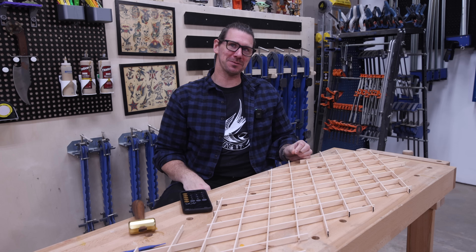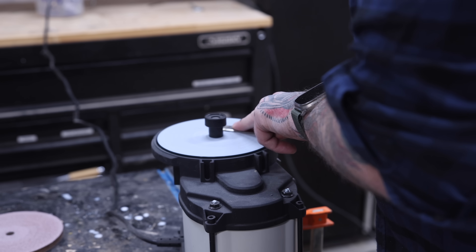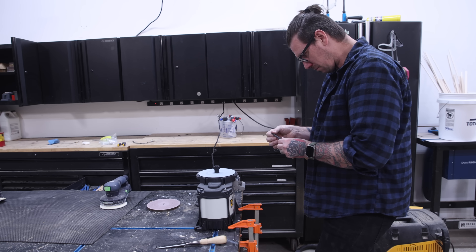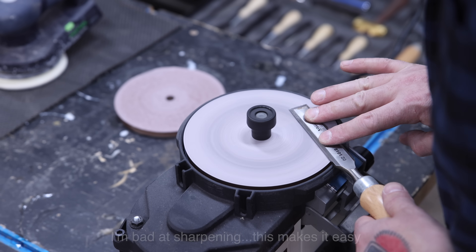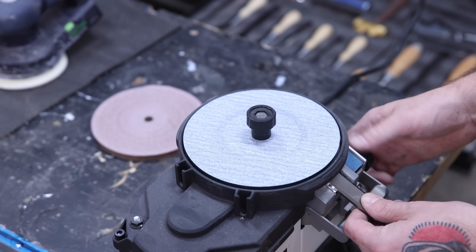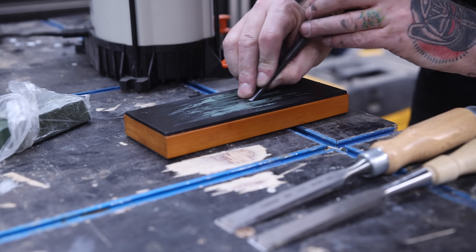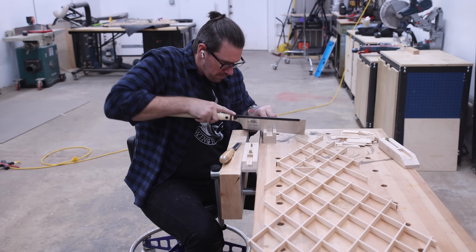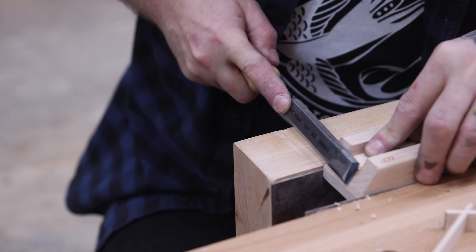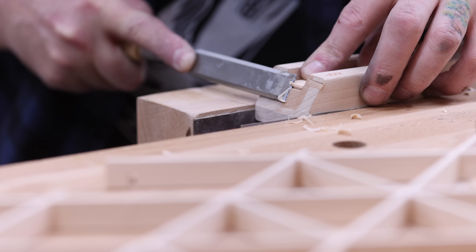Johnny Trumbukas told me one of the most important things to remember is to always have a really sharp chisel. So I picked out three different chisels to sharpen to find my preferred one. I'm using the Worksharp system — I have no affiliation with them and bought it myself, but I do think it's the quickest and most straightforward method of sharpening chisels. My chisels need to be extra sharp since I'm making this out of hard maple. If I was just making this panel as a piece of art I'd use basswood, which is much softer and cuts much easier. But since I'm pouring epoxy over the panel, epoxy staining is a real concern, so that's why I'm using the maple.